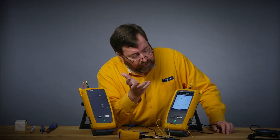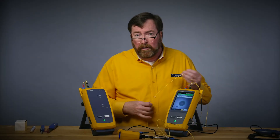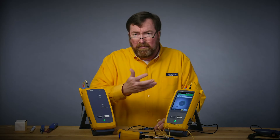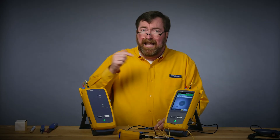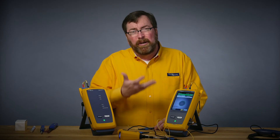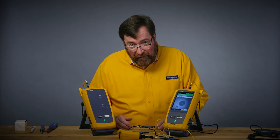Do I need to save the images or not? It depends a little bit on your contract — does your customer want you to save all those end faces? A passing end face isn't the most exciting thing, but think about what's going to be done with your link after you leave. If someone comes along in a week, a month, or a year to plug in some active equipment, you might want to save that end face image, so that when the next person plugs in a dirty patch cord and screws something up, you have documentation to say: when I left, this was in good shape. It's not that you won't have to come back — it's just that you won't have to pay for the return trip.